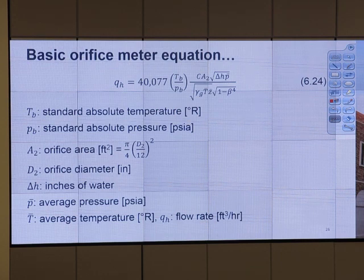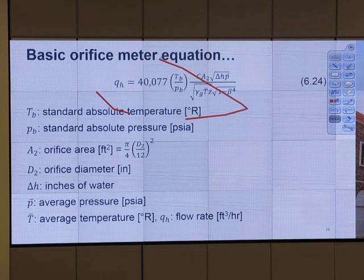So meter run is about orifice plate. Okay, we can also use Coriolis flow meter for gas. Coriolis flow meter also works for gas. It is also good for liquid, okay, for single phase flow. It can be used for multi-phase flow, but that's not good, okay, because you don't really know how much is gas or how much is liquid. If you have like 50% liquid, 50% gas, Coriolis flow meter will give you mass flow rate and the average density, okay?